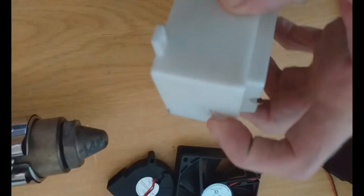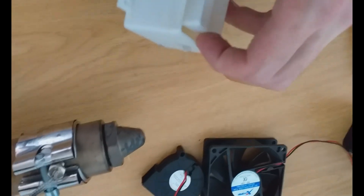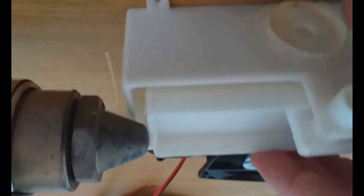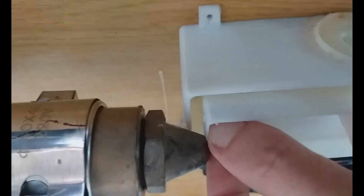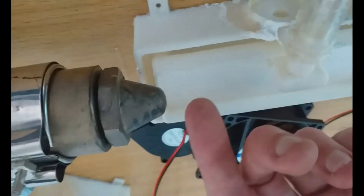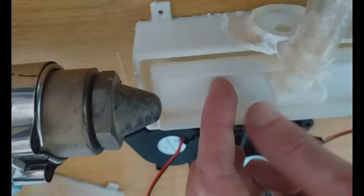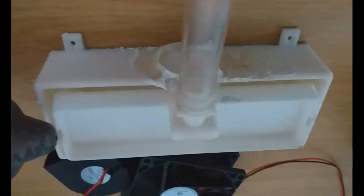The general issue here is the plastic - this is PLA. If PLA sticks to other PLA, we'll probably put some sort of coating over the water bath components. That's one of the issues with just putting the water bath right there. The issue is when the filament comes out you need to grab it and pull it all the way through. Once it comes out and touches other filament it kind of sticks. With water it doesn't stick, but then it's already like a blob - it's super hard to work with. With the smaller water bath, the filament comes out and makes a hyperbolic loop type scenario - it falls down, touches the water, then the puller lifts it up again, which it shouldn't do either.